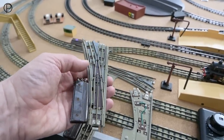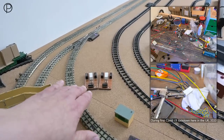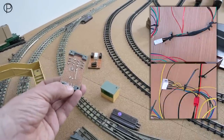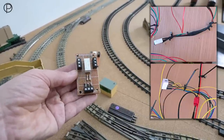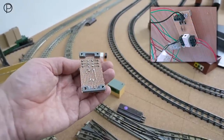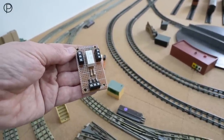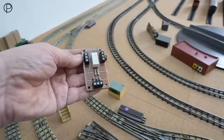So I ended up using relays — I showed them in earlier videos on the last railway. I started experimenting with them during lockdown. Initially I was wiring them directly and they weren't mounted on a board, which made them cumbersome, not very reusable, and fragile. I graduated to sticking them on a bit of matrix board. The first matrix board I had didn't have copper contacts on the back — it's actually nicer to use than the current stuff, but availability became an issue.